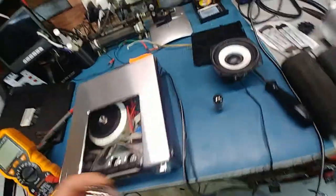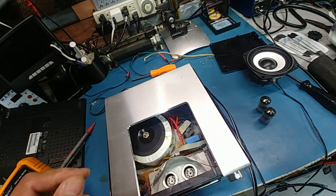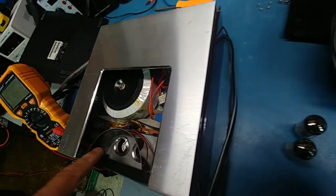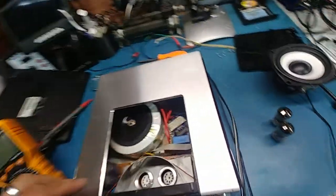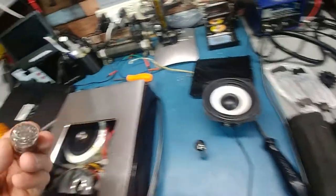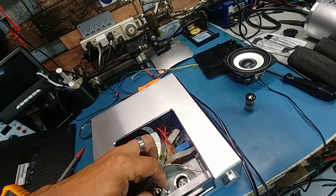Makes you wonder if they're even still good. Anyway, I still managed to get the back end to power on including the digital amp. I still haven't figured out how to get the front to power up, because it wouldn't be just the tubes - there are LEDs and all kinds of things in here that would light this area up, and I'm not detecting anything. So I'm going to put the tubes back in and start poking around on the board to see what we can find.